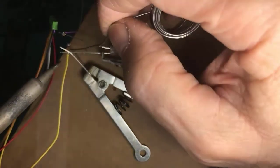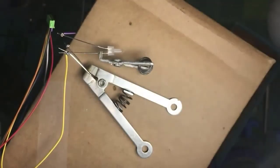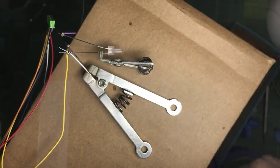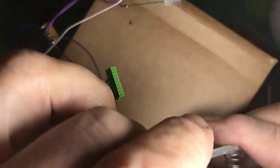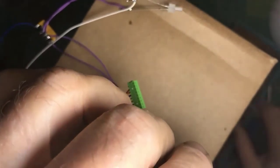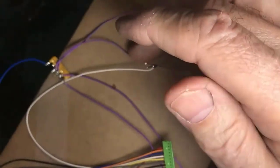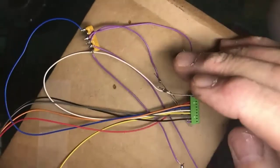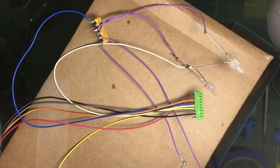Now, clean the tip, apply the tip to the work, let the solder flow to the work, and inspect the finished joint, which is bright and shiny. And now we have, ladies and gentlemen, I'll let you decide who of you is a lady and which of you is a gentleman, and then the rest of you, which are just model railroaders. Here we have a completed soldered installation, minus the tears and frustration of actually getting the LEDs to sit properly where they need to sit inside the model. The resistor array can simply be glued in somewhere out of the way inside the shell.